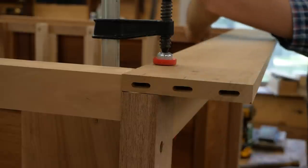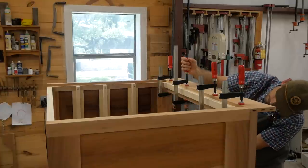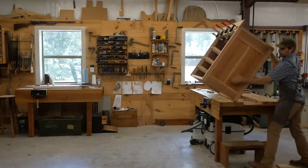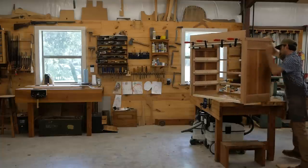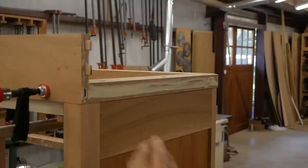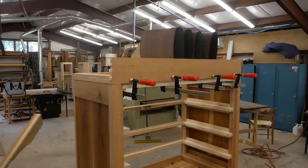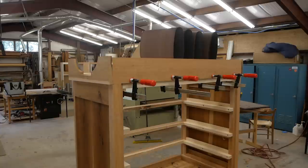There's also a frame on the bottom of the dresser that I built to allow the trim to attach to the apron. With that back piece on, I just have to flip the dresser — it's starting to get really heavy. Once flipped, I can start gluing and nailing on the bottom apron. You can see those little dominoes going in, almost like floating tenons — they help secure the side apron. I cut a profile on these using the bandsaw with a pattern.